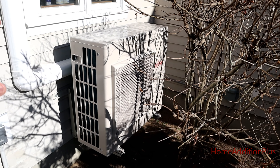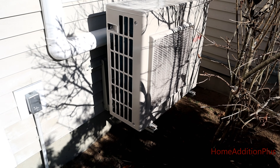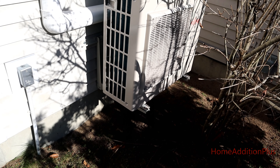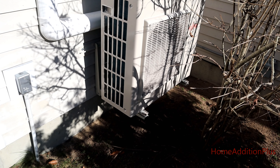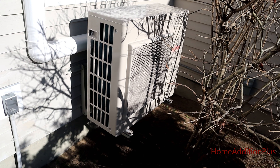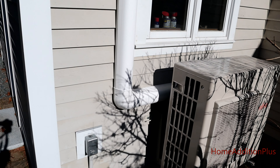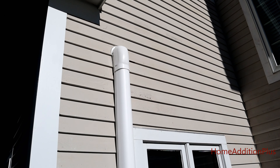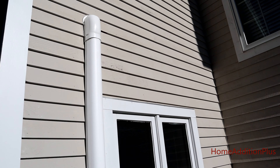On the outside of the house, this is the condenser compressor unit. As you can see, we have it mounted so it basically attaches to the side of the house. It's not sitting on the ground, though you can get them assembled so they stand on stands. I like it attached to the side of the house so that it's off the ground, away from any snow. You've got this ductwork piece that goes up the side of the house and into a three-inch hole that feeds the evaporator on the inside of the garage. And that's it for ductwork.